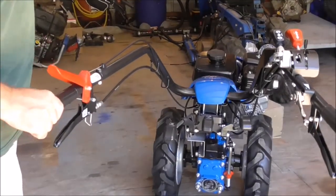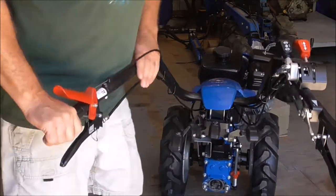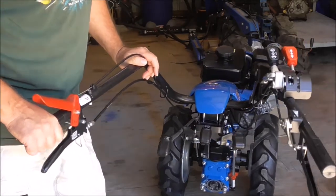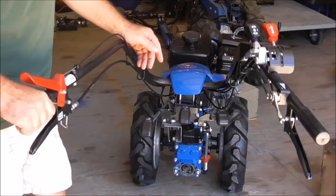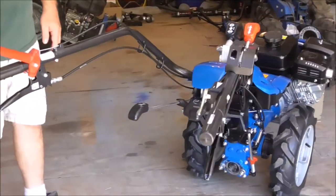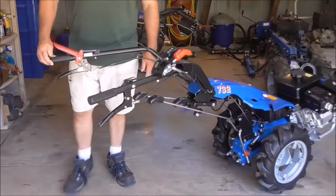What's the differential? It allows the machine to turn very easily — the wheels can freewheel and move independently of each other. For those that have used almost any typical American tiller, what most anyone's used to is a machine that has a straight axle and the wheels are going to bind when you turn. At the end of your row, if you're tilling, you pretty much have to muscle the machine, flip it around and make your turn. Not so with a machine that has a differential. I'm moving the machine around here, holding onto the left-hand bar with two fingers, and it takes no muscle whatsoever to turn.